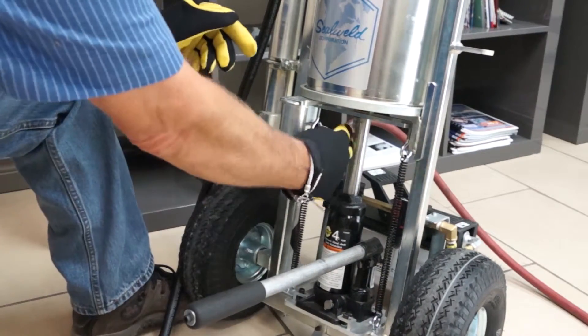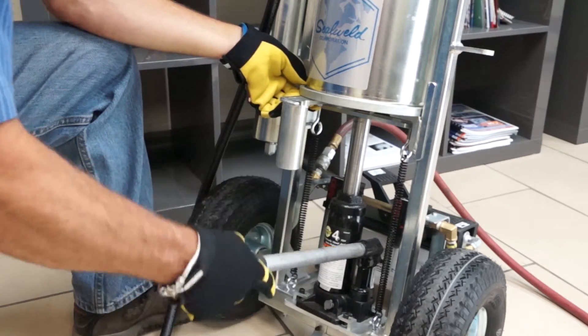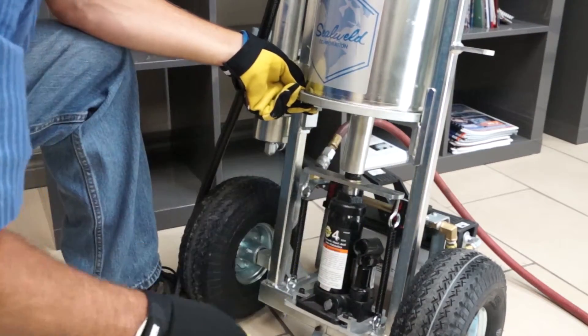At the halfway point of the product pail, you need to engage the elevator plate extension arm to load the last few pounds. Drop the jack completely and swing the arm under the pail and center over the jack.